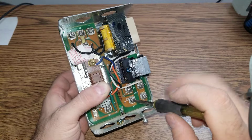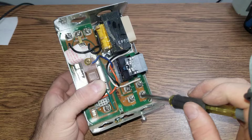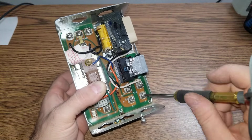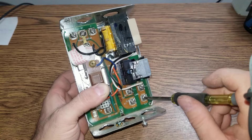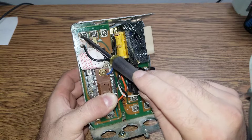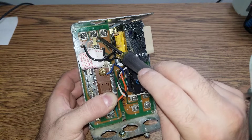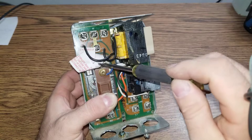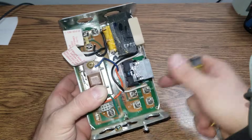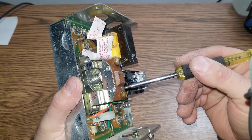There are also the L1 and L2 connections — L1 is 120V and L2 is neutral. On top we have terminals W, T, and TV, which are for the thermostat. This section here is the Aquastat itself.